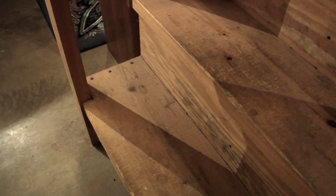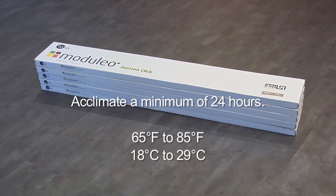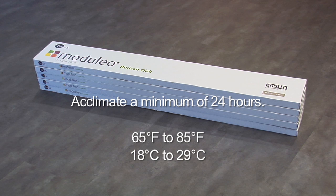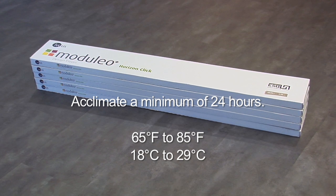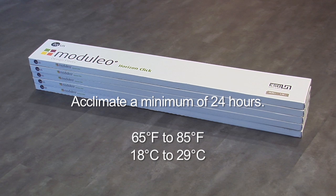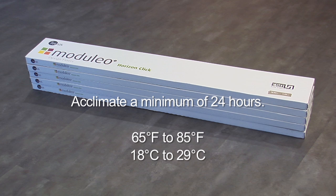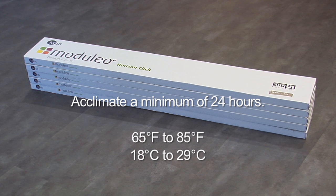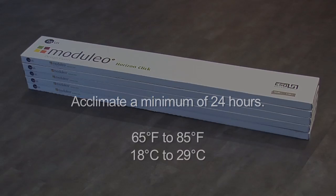and/or landings. Acclimate the cartons of flooring a minimum of 24 hours before installation in the area it is to be installed. Conditions are required to be between 65 degrees Fahrenheit and 85 degrees Fahrenheit, or 18 degrees Celsius and 29 degrees Celsius, before, during, and after installation.